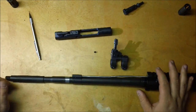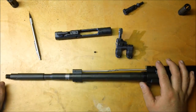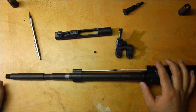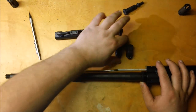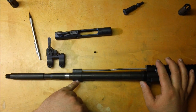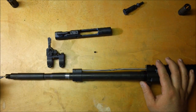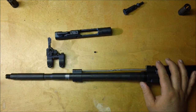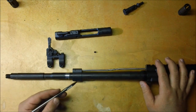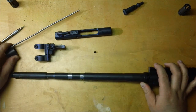With the other style of gas block you don't really have that option. The only other option — and I've seen ADCO, one of the well-known companies for drilling and welding, do this for guys who don't have those skills — is to put it on a mill and drill a pinhole through either type of gas block so it can actually be pinned. Maybe in the future I'll do a video on that. But the best option, no matter what type of gas block you have, is to have it pinned. That will help you avoid a lot of malfunctions and add a lot of durability to your rifle. Thanks for watching.